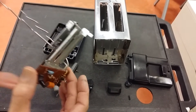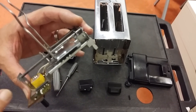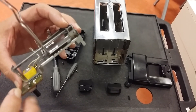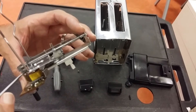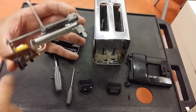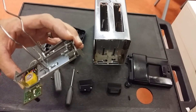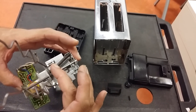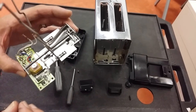Where does it whoosh through? Through our electromagnet on the other side — also called a solenoid. You just get a pulse of current, a pulse of magnetic field, and that pulse of magnetic field will suddenly pull down and release the mechanism. This circuit only has to do a little pull on a steel tab — the actual pushing of the toast back up again is done by the spring, which we've put our own energy into. So the circuit only has to do a little release.